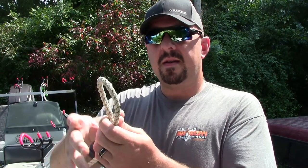I've used this anchor a lot on the Mississippi, on the Ohio, in lakes — I've had it hung up in just about anything you can name, and I have yet to lose an anchor. After saying that I'll probably lose it next time I go out! If you get it hung up, get those zip ties to break, start pulling, and you can usually pull the anchor out backwards — it'll come out of the snag the same direction it went in. There have been times I couldn't get the zip ties to break, so I take my anchor line, double it through one of my cleats, and if I have to I'll fire up the outboard motor and pull against it to generate enough force. If you rig your anchors up that way, 99% of the time you're going to get them back no matter what they're snagged in.